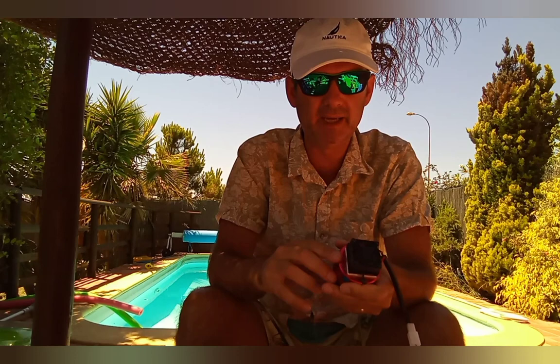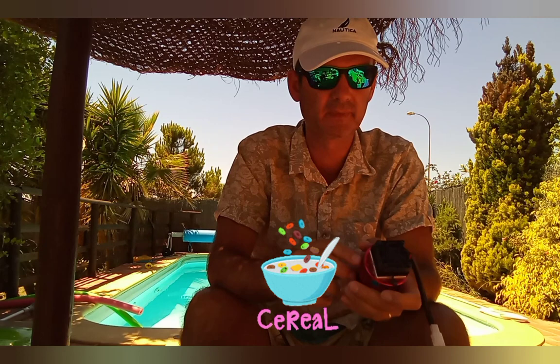You also can improve and boost the power. For example, I will give you some ideas if you are a guy that likes to do it yourself. You can stack peltiers if you want a little more. For example, if I want more, I may do that experiment, and if I do, I will record it. Because if you stack the peltiers, it will boost the power. But be aware that there's a difference connecting in parallel or in serial. In serial works better. That's for you to know.